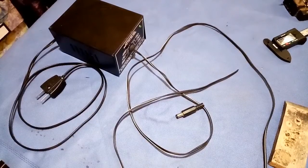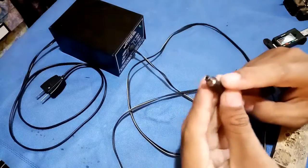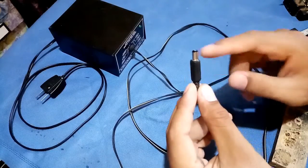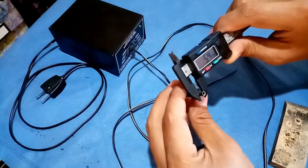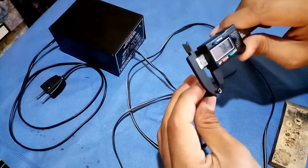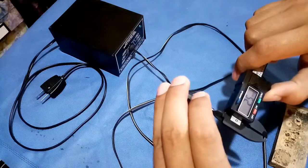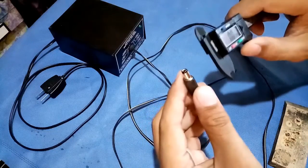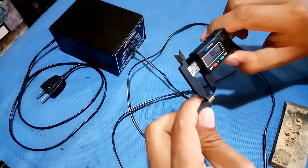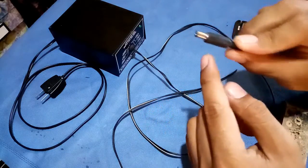Hello friends, welcome to my channel. Today's video I'm gonna share how to replace a DC plug. I'm holding here a DC plug you can buy at an online store. There are many various types of DC plug, but here I'm using a 5.4 or approximately 5.5 mm outside diameter DC plug, and the inside diameter hole I'm using here is 2.5 mm, and the height approximately 9.5 mm.